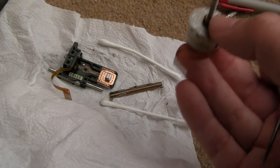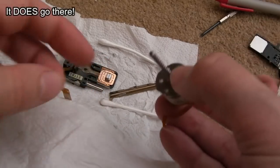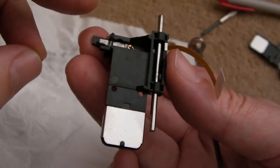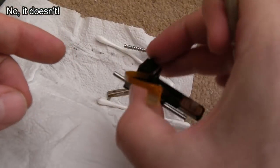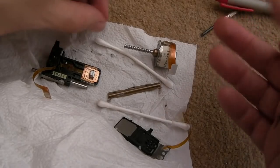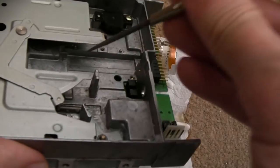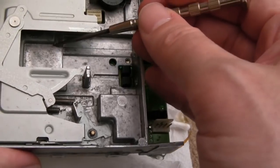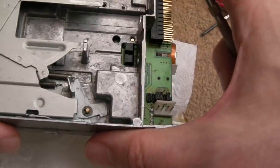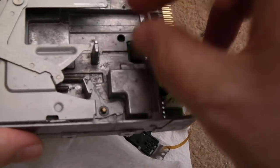I realized there's a ball bearing here which I think goes under here, at the point where it meets with the rail. Everything has come to pieces - I've taken everything out. The ball bearing flew off somewhere and it took me ages to find it. Cleaned out in here with the wire brush again. There were some bits of metal and corrosion - I don't think it was making the head restricted when moving around. These parts are aluminium. Look at the hair that came out of there.